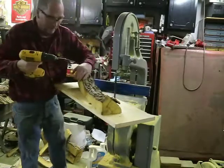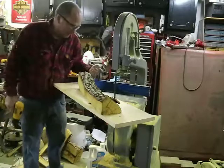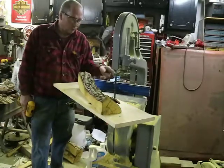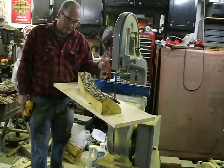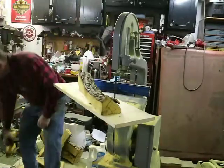One thing, if you're sawing hedge on an old Rockwell 14 bandsaw like I have, this one's very similar to what the old school shops had. This is the old 2-speed. It has the gear change in the back where you can drop the speeds way down on your blade, put a very fine tooth in it. You can actually cut metal on this saw as well.